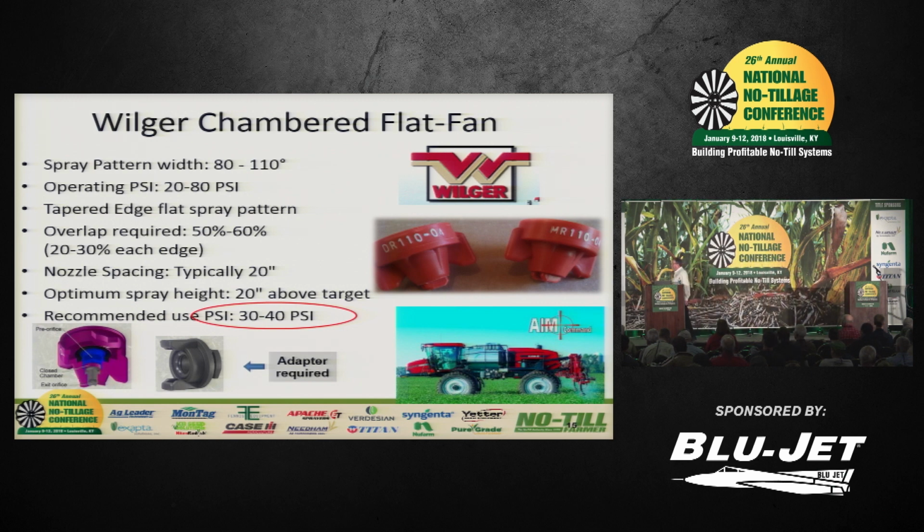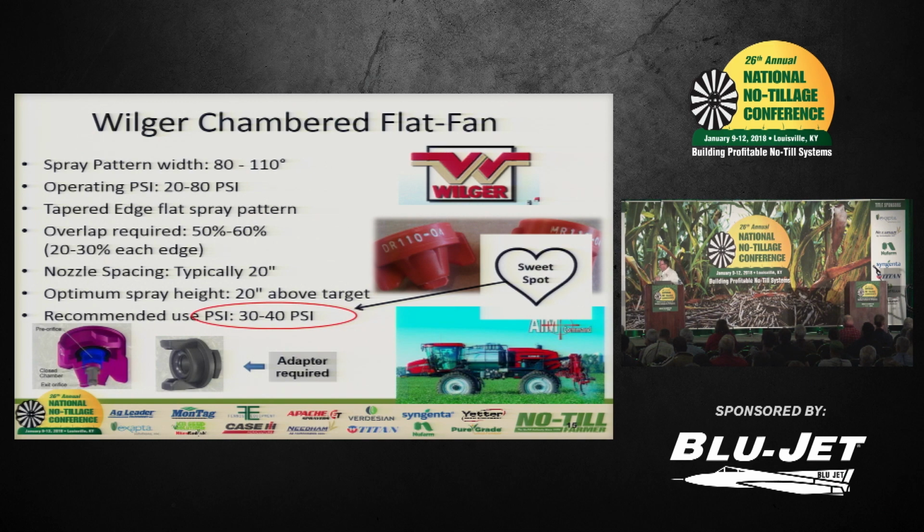It's a chambered flat fan. It has some of the characteristics that we've already covered, and it has a sweet spot, 30 to 40. But it's not built to go on a common nozzle body. It has to be a Wilger nozzle body. So it's not been one that I've highly recommended to people to switch out. There's no reason to because of the complications of using what's called an adapter. Now, they'll be glad to provide you the adapters if you want to go that route. And there's nothing wrong with that. But if you're going to buy a Case IH sprayer or a sprayer equipped with a Wilger boom, then it'll already be set with that system. And there's nothing wrong with that.